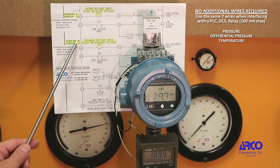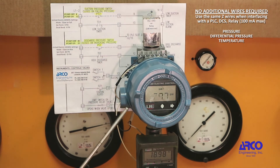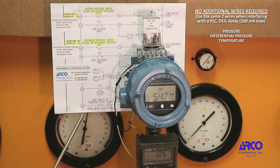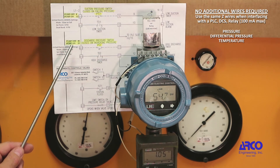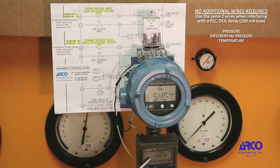The pump turned off at 80 PSI, and now the pressure is dropping. We are coming down 25 dead band to 55, and the switch has reset — pump turns on, back to 1 milliamp. And so on: back up to 80, switch tripped, 19 milliamps; down to 55, pump back on again.